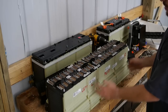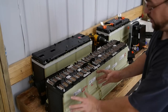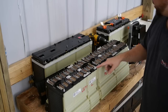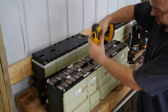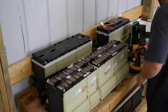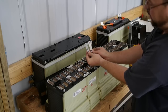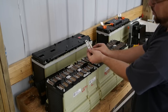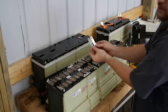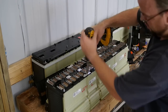There's a pack here — that's two 48-volt modules put together, and here is a 48 and a 24. They're all connected by these different bus bars. Some of them carry current; some are just mechanical ones to hold everything together. This one is actually not connected electrically, but you still have to be careful pulling it off. You can see the difference between the electrical bars and the mechanical ones. The electrical ones look like they have a silver plating, probably for galvanic corrosion protection, as opposed to the others which look electro-galvanized.